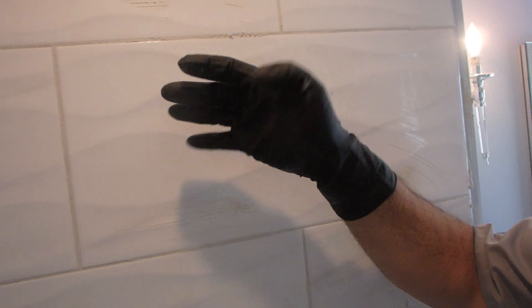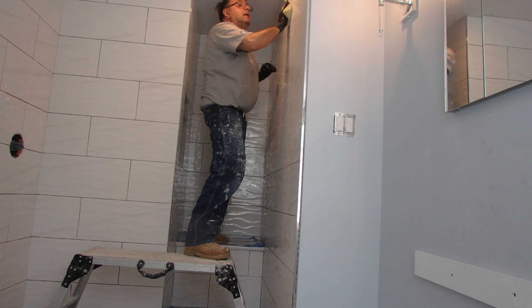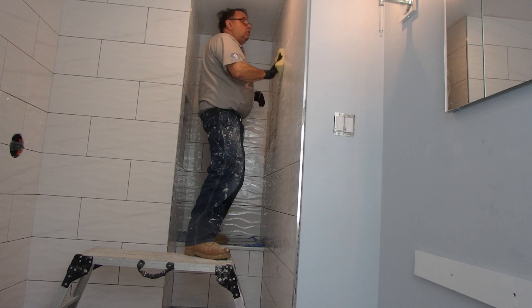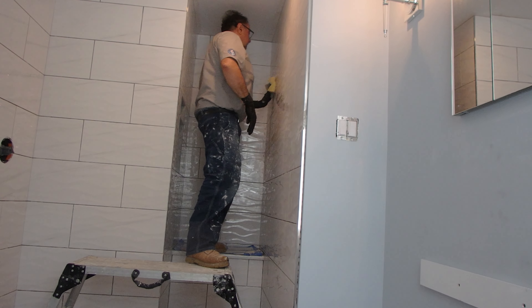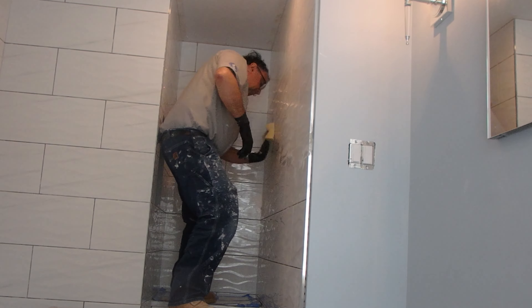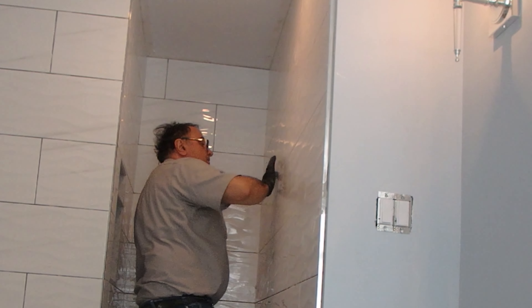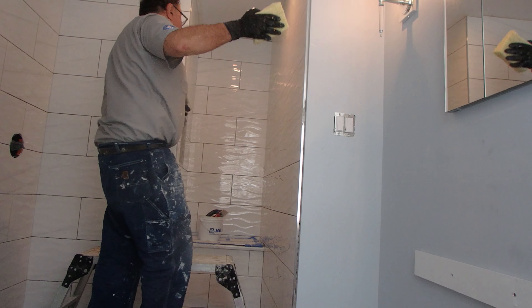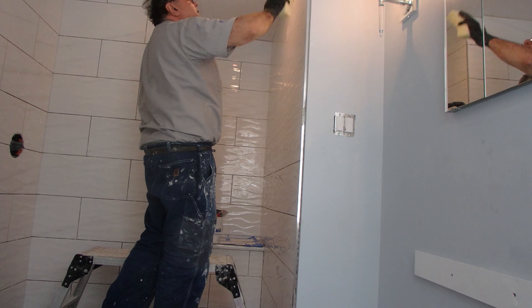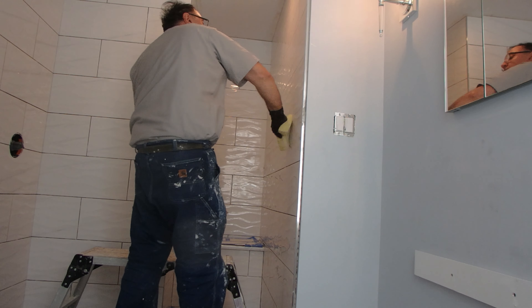Because this is a very porous tile, when I touch the grout and nothing transfers to my finger, that means it's ready to wash. It's going to take a lot longer on the floor, so start washing right away. Get all the tile clean, work the joints to get them nice and even, then rinse — pull in one direction, flip the sponge over, and keep going.